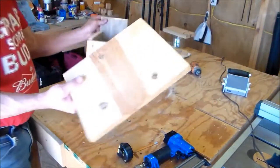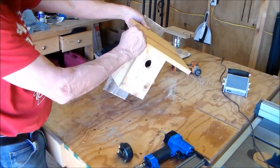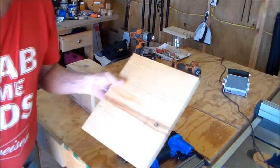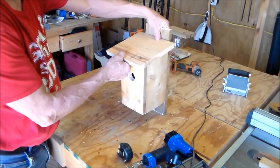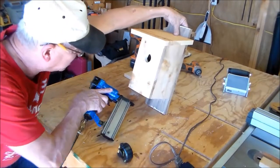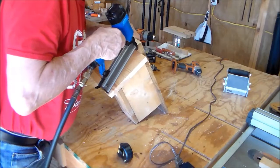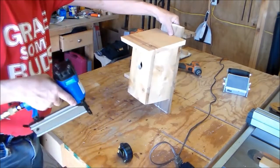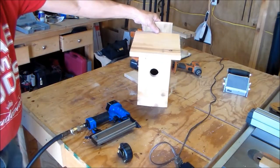For the roof, I've got a big piece here. I'll cut a ten-degree bevel on the front and the back to give it a little character. That'll fit right on like that. I just eyeball it — you know where the center is. Pack a brad nail here and here, and it'll hold it in place. Then drill a hole and put a screw in on each side.